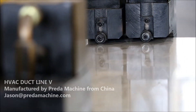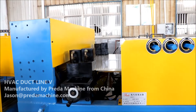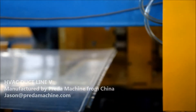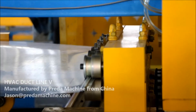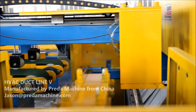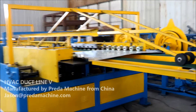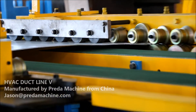Characteristics of our duct line 5. First, optimized linear structure makes the whole line beautiful in appearance and fast in production. Second, 11 rollers are equipped for leveling to make sure the plate gets even. Three, this machine is a material saving facility with only less than 20 millimeters of wasted plate per roll. Four, a highly advanced servo system controls the whole production line, so products are perfect in appearance and precise in size. Five, one man is capable of handling the whole line. Six, work pieces counting system to count daily and accumulated quantities.